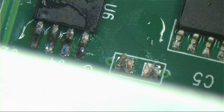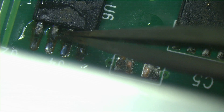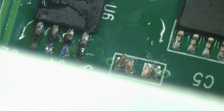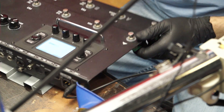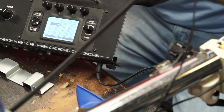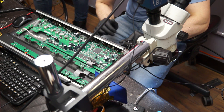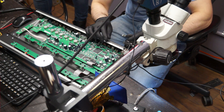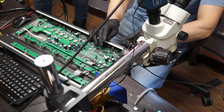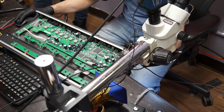Now we make sure it's actually soldered to the board, which means poking each one a little bit. That's clearly soldered. The legs on this side are messed up, but it's soldered. We have booting — it says 'set lists' — so this is progress. Now we see if USB works or if it blows up my computer. We moved some of the pins around so they wouldn't be touching one another, because the pins were touching. This does not feel like the nicest port.